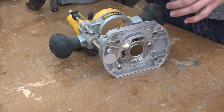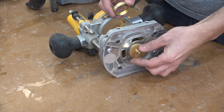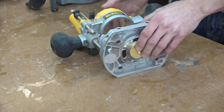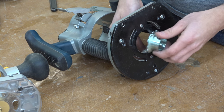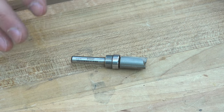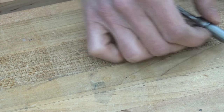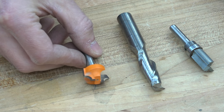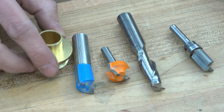How you mount these things in your router is going to depend on the router itself. My Dewalt router takes these Porter Cable bushings — they just pop right in on the bottom and then a little band gets screwed in to the other side. The Bosch router has a guide bushing holder you can install, making it really easy to get them on and off. The real power of a guide bushing is that you can turn any bit you want into a pattern bit — a straight spiral bit, an oval bit, or even a dovetail bit — all using just a guide bushing.